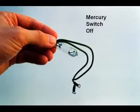Aside from the problems of tube breakage and spilling mercury, which is a toxic material, and susceptibility to vibration, these devices are an excellent alternative to open-air switch contacts wherever environmental exposure problems are a concern. Mercury switch contacts are impractical to build in large sizes, so you typically find such contacts rated at no more than a few amperes and no more than 120 volts.